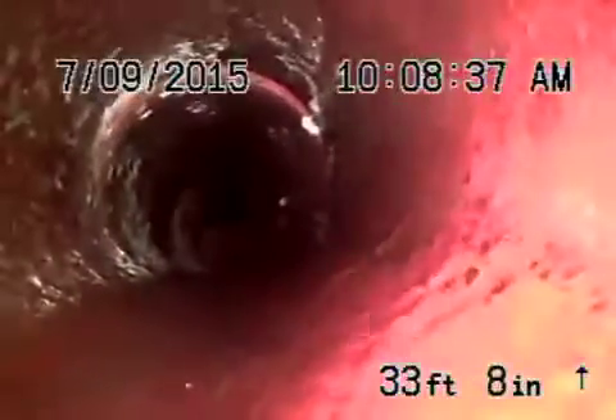Still clay coming back. Overall looks pretty good — the sewer going down towards the bottom. We did not make it all the way out to the street, so we're definitely going to recommend putting a clean-out further down. A little bit of a shift there as well.